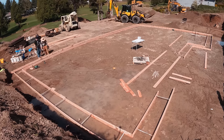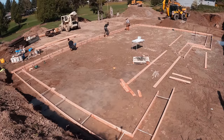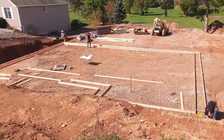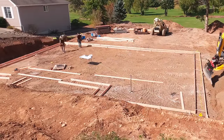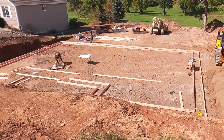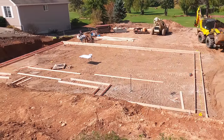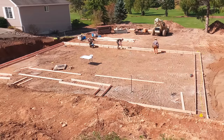Now it's time to straighten the back. We know our length is correct on that leg, the length is correct on the opposite leg, and the diagonal is correct. Now make those all straight. Since the right-hand wall and the back wall are nice and straight, those are going to be references for the north-south walls and the east-west walls, including interior strip footings. And because it's square, then every other wall that stays parallel to the wall you measure off of will naturally be square as well.